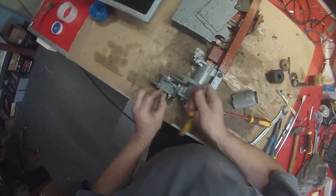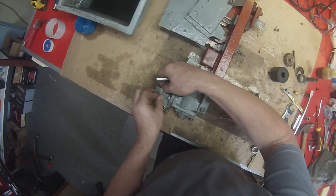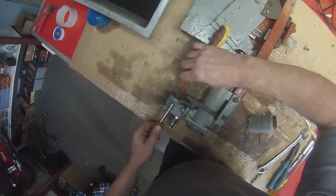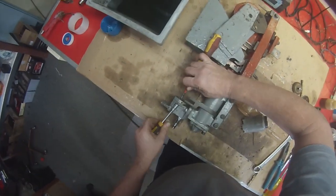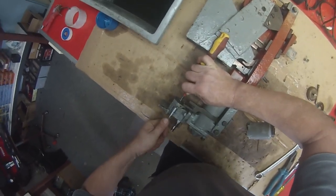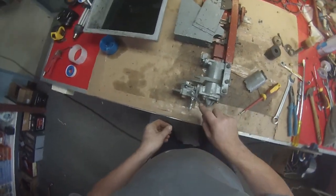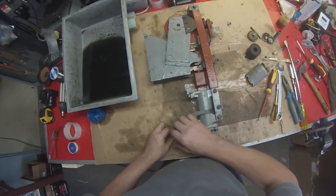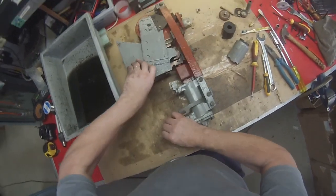As I've said before, this switch has gone surprisingly easy. I haven't had any specific problems with it, which is rare. Every other switch I've had has had some frustrating problem with it. I haven't been able to undo something, or do something up, or something hasn't worked. Quite often the valve block is damaged inside, so it keeps blowing past. Doesn't matter which pin I put in, it still blows past, so then I have to change the whole block for another one.